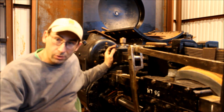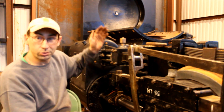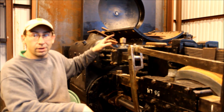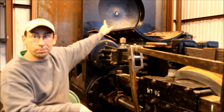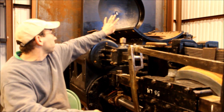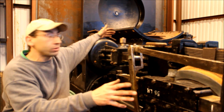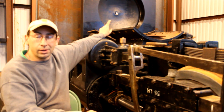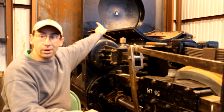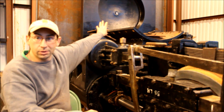We're going to do things a little bit different from the way normal steam locomotives are done. Normally, steam locomotives don't have a big front plate out there where your smoke box front bolts to it. In this case, the boiler also has to bolt to it. I have a ring of 3/8-inch steel that goes up there as a flange. When we put the boiler on, the boiler will go up against the 3/8-inch steel plate, which will be up against that plate there. Once we get everything figured out where it needs to go and get all the holes reamed out so we can put new bolts in, we weld the front of the smoke box barrel to that flange, and then the flange is bolted to the front. There's a gasket in there, so basically it's a way of making that connection airtight.